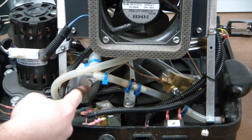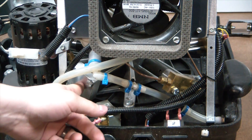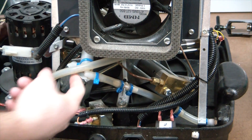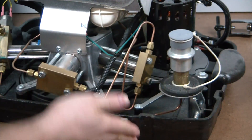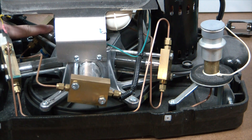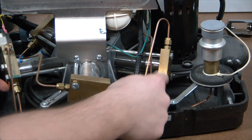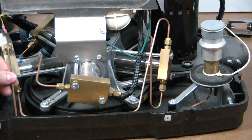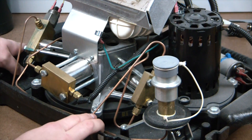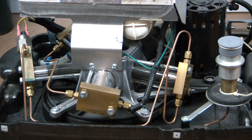Obviously your first stage is the biggest one, taking the lowest pressure. That comes right from the manifold going over to the second biggest, then to the third, fourth, and fifth — beautifully designed. A great way to keep motor requirements minimal for high-pressure work. Really cool little design — I love that.